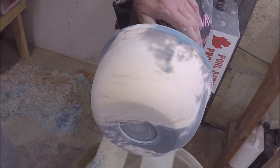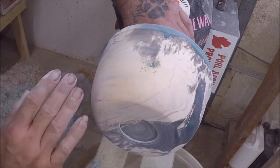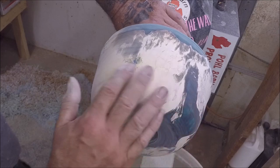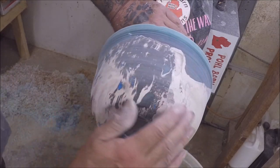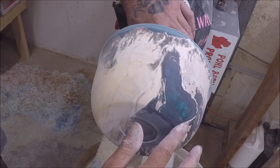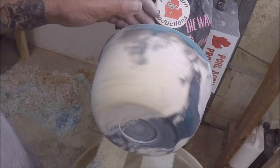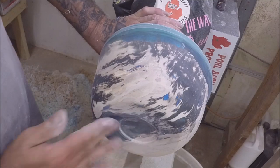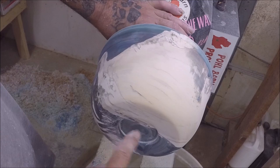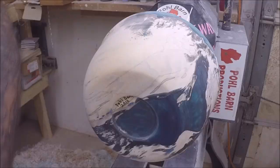Alright, so I've sanded from like 60 grit to 320. The problem I'm having is this is almost too far gone, so it's really soft. So my resin is higher than some of the spots in the wood because the wood's just coming off. So I'm going to stop right here. It's really low in the resin. We're going to put some sand and sealer around it, do the abrasive paste and the polish and probably some shine juice. You know how it is. That's how I roll. I try to get a pull burn in there. I've got this little itty bitty spot to put it in, so we'll see if we can do it. Yeah, let's get to that.